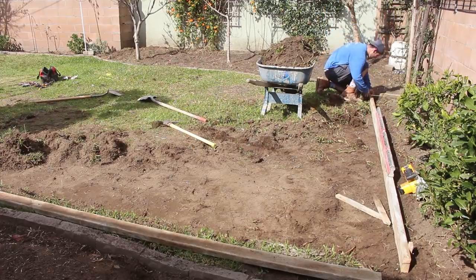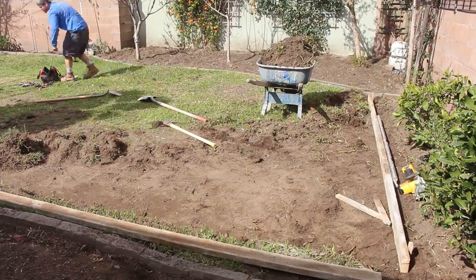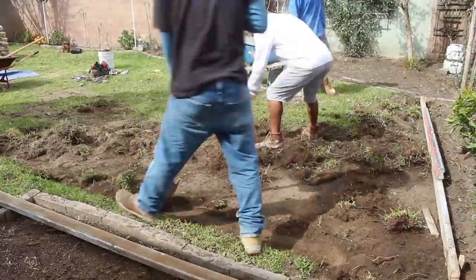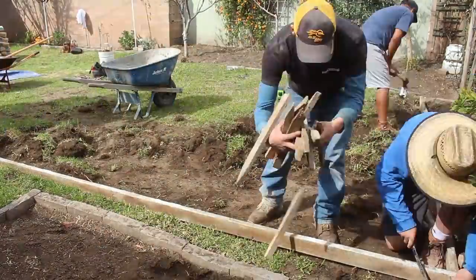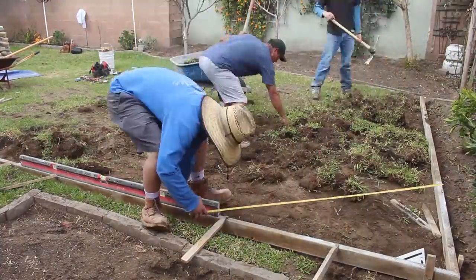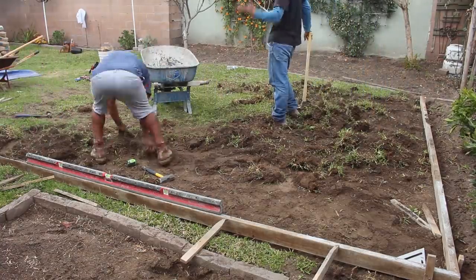And what I'm doing right now is I'm just measuring off the back of that wall to make sure that my form board is perfectly straight with it, because I want to start with something straight. And I know that wall was straight. And you can see me and Sam actually started off with a 3-4-5 method to see how much of a 90 or square we were. And we do end up using a 6-8-10 method.